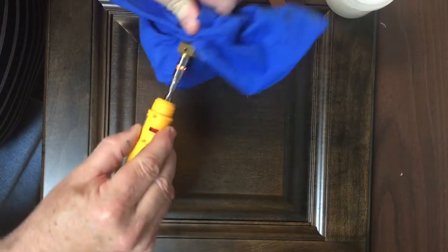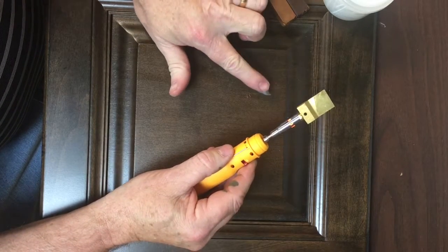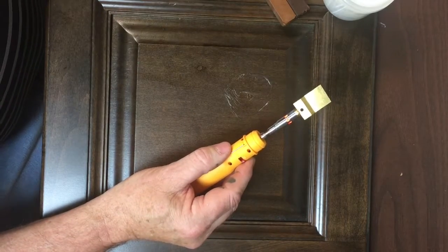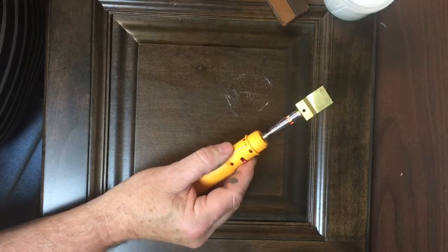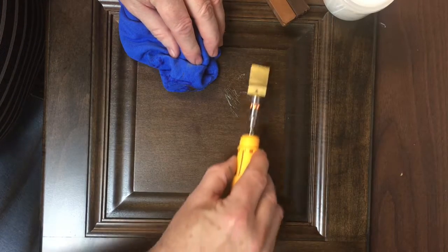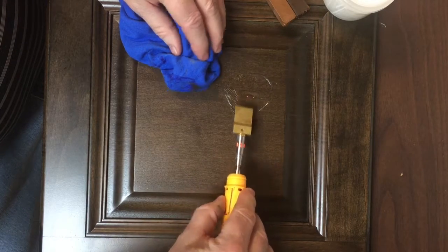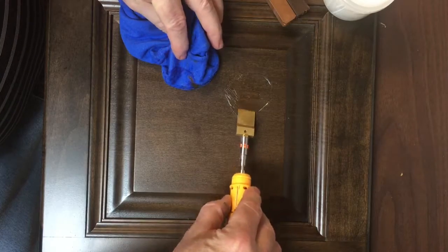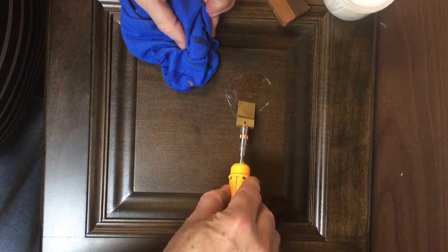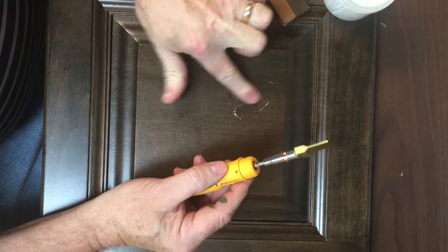I'll clean the tip of my blade off so I don't have that material sitting there cooking on the tip. I'm going to take my burn-in lube and put it around the defect. The burn-in lube keeps us from burning the surface and also allows me to pick up the excess material. I like to go across the grain with a motion like an airplane coming in for a touch-and-go landing — lay it on the surface, let it touch it, and then transfer the material to the rag immediately.